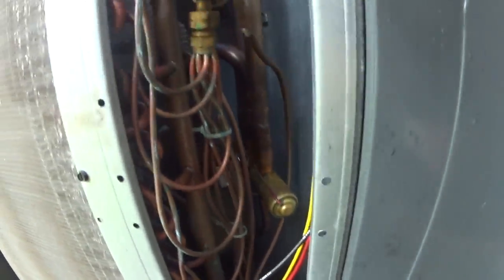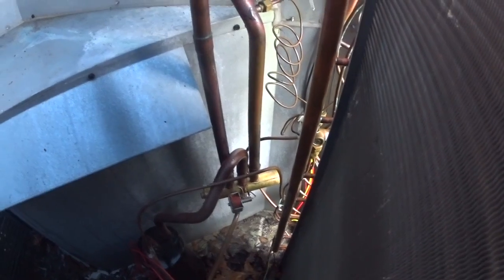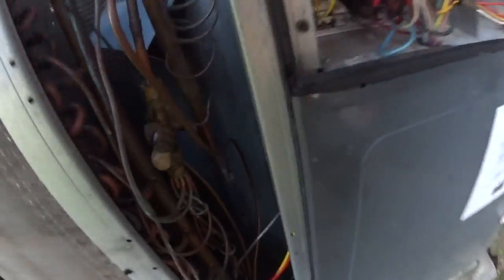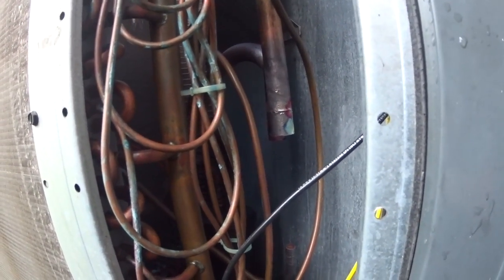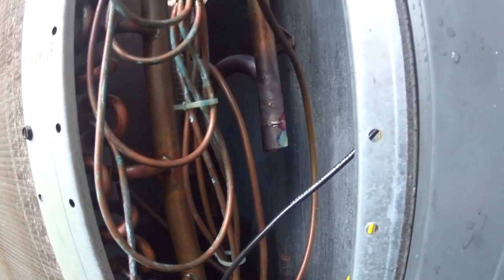Here's my reversing valve back in there - from the top side down there, trying to figure out the best way to get it out. We got the thing out - wasn't actually as bad as I thought it might have been. Got the pipes in place and it shouldn't be too bad to get it back in. Worst part is going to be if I get one pipe hot and it won't budge to allow another pipe to come in, but so far not quite as aggravating as I thought it might be.